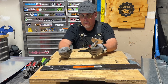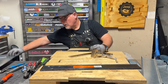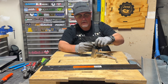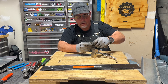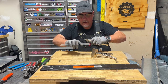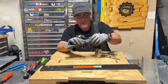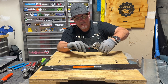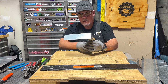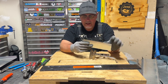If I just wanted to bend up a piece of metal, the best thing to do is make yourself a mark. This is a scratcher for scratching the metal. I'm going to scratch a one-inch mark across this piece of metal — that'll give me something to guide these sheet metal tongs. On this small one, I'm not going to put the relief cuts on here because I just want to show you how these work. I'm going to line that edge up there and bend that. I'm not using a two-by-four and a hammer to bend it, not getting a bunch of dents on the metal — getting a nice crisp bend.